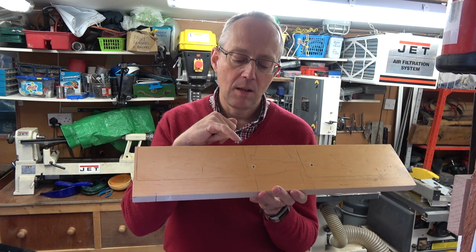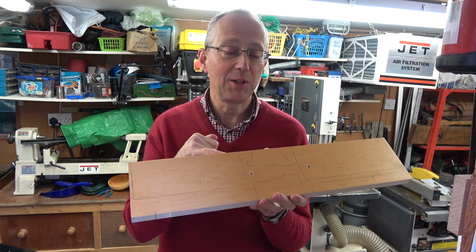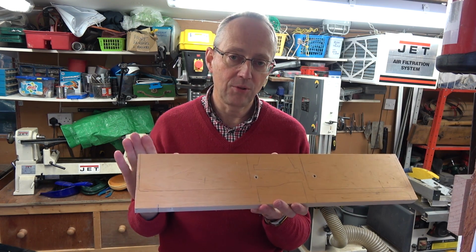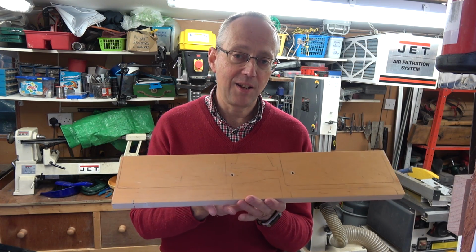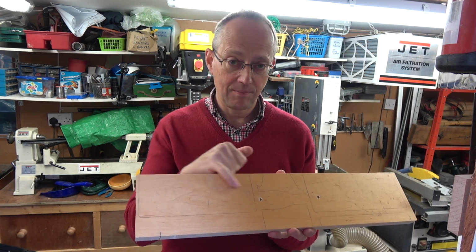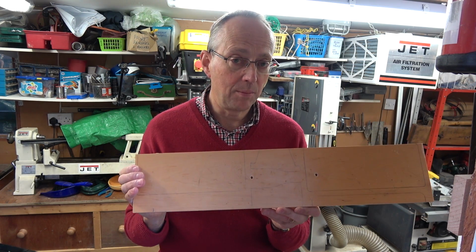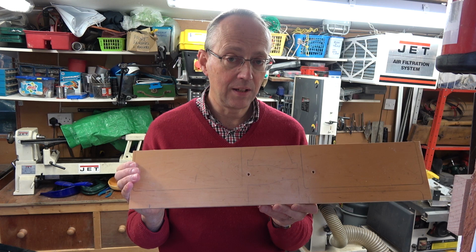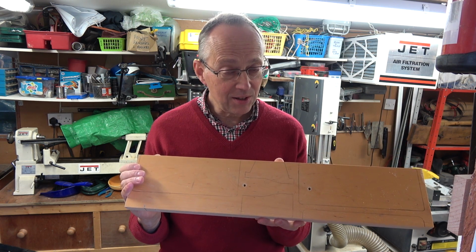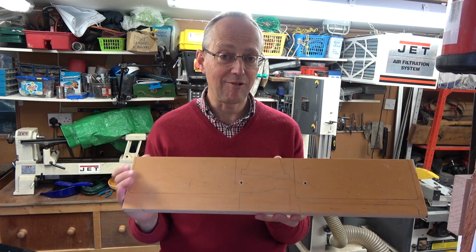I'm going to then bend the metal cutter around them using a special bending jig. Then I'll fix it with some nails or screws or something, and hopefully I'm just going to rely on the outside being sort of nailing the cutter. That will do the job. And I've got a 15-ton press. I'm going to pop it in, and if it all works I'll have some wallet shapes and it'll be a means of cutting them out quickly and accurately.